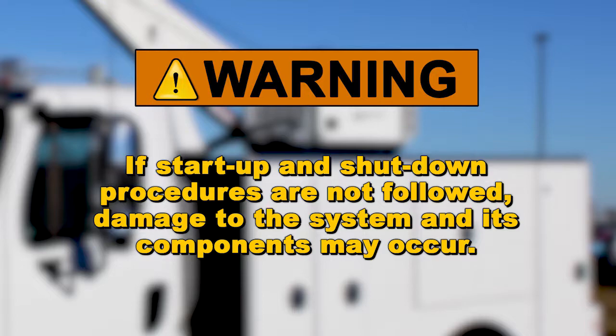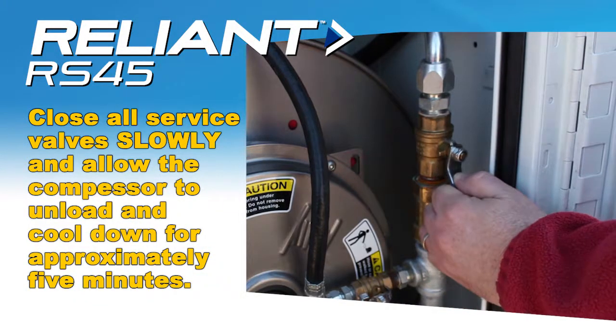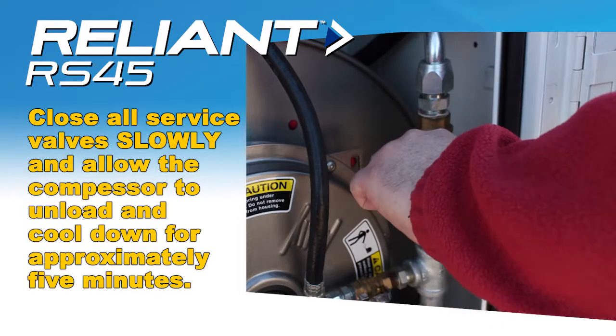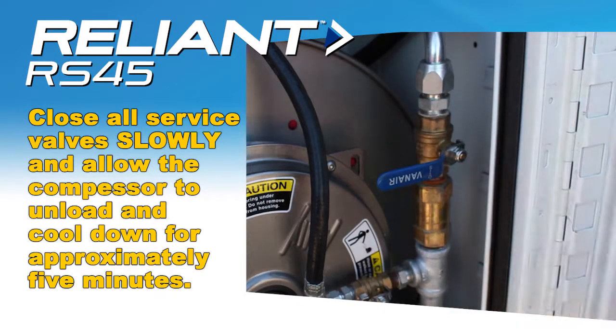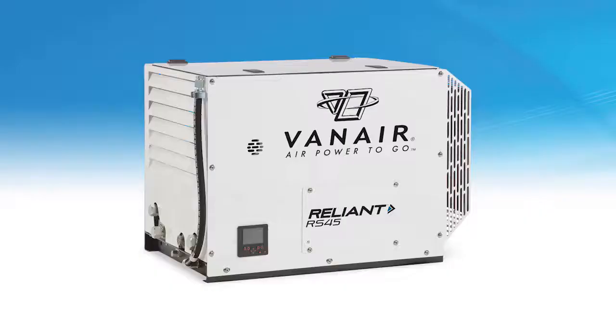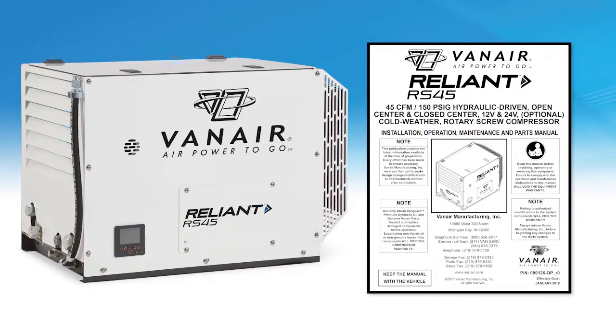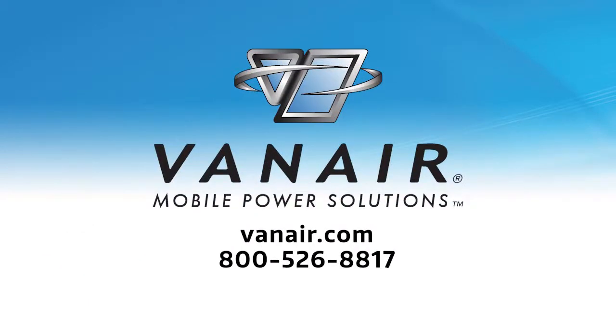Warning: if startup and shutdown procedures are not followed, damage to the system and its components may occur. Close all service valves slowly and allow the compressor to unload and cool down for approximately 5 minutes. Disengage the hydraulic system. For further operating procedures and functions, please refer to your operational manual or call Vanair at 1-800-526-8817 for further assistance.